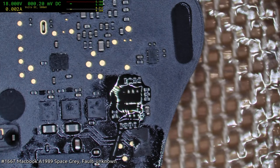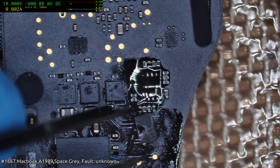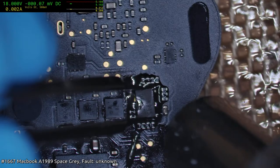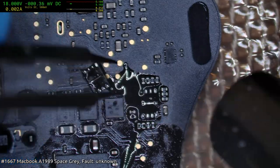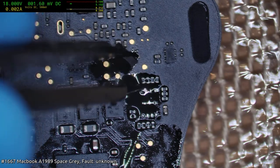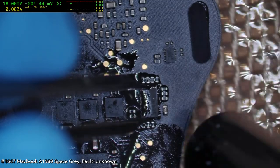The other possibility, of course, is that the communication lines to this chip from the CD3215 are problematic. I probably should have actually tested those lines before I did the replacement, but... why? Gripping on a little bit too tight, it seems.